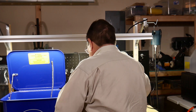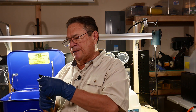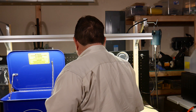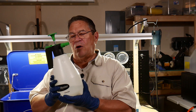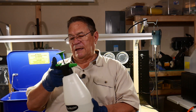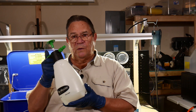I'm also going to recommend that you take some time to purchase one of these parts cleaning brushes. They used to be nylon and wood and didn't last long. This one has stiff plastic bristles, a plastic collar, and a plastic handle, so it might work a lot better with the solvents. And I always keep a hand pump bottle — you can buy these at big box stores like Home Depot or Lowe's in the garden center. They're used for spraying, and I fill mine with distilled water for that final rinse, rinsing it right back into the parts washer.